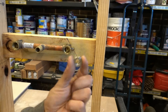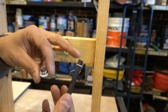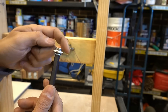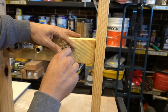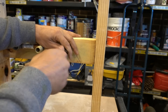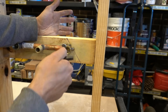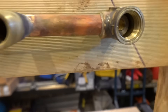The next thing we're going to do is install our new tap seat. Use the allen key — this time the long side — which sits up against the washer. If you like, put a bit of thread sealant on here like Loctite to ensure a 100% sealed area. Simply push it in and thread it on slowly because we've still got fresh threads, all the way through until it bites on completely. Make sure that's nice and snug. This here is the finished product — a brand new tap seat ready to go.